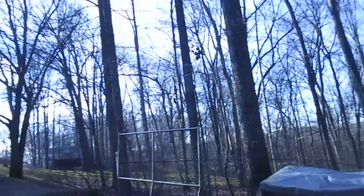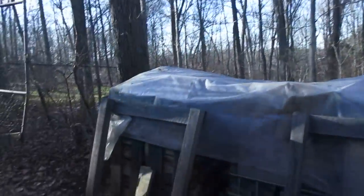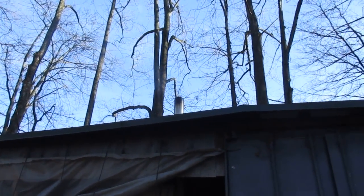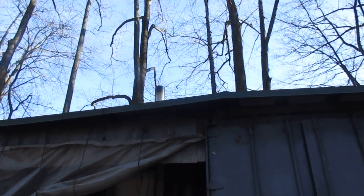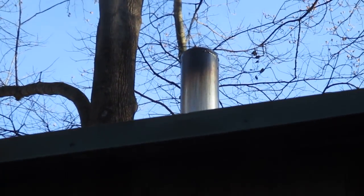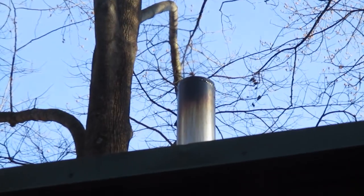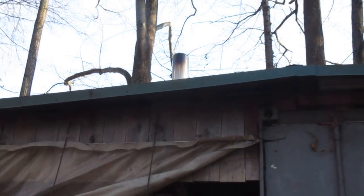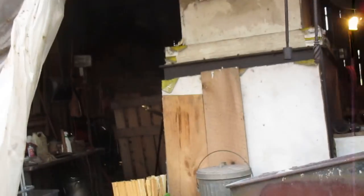We're sitting at 360 up there and still climbing. The stack should probably be clear-stacking by now — it always gets dirtier with fresh wood, but now you're almost clear-stacking up there. There's a little bit of smoke but relatively little. Like I said, that's new clean fresh wood; it's below 10% moisture content. The stack temperature already almost made it to 400 but it shut off.